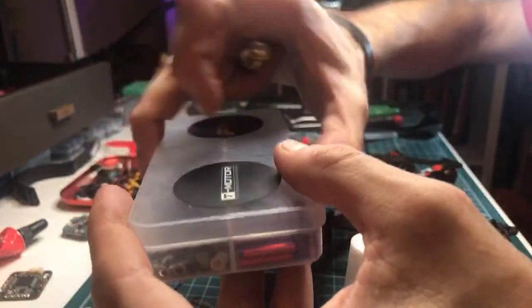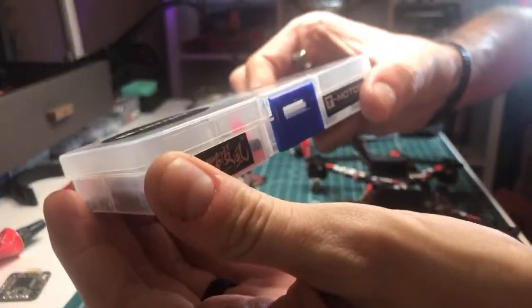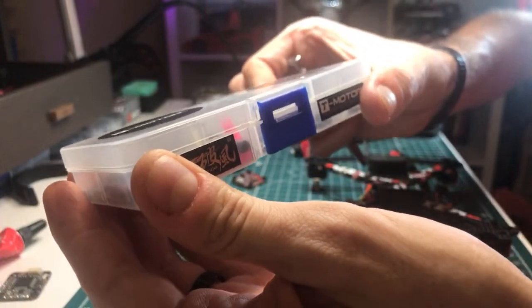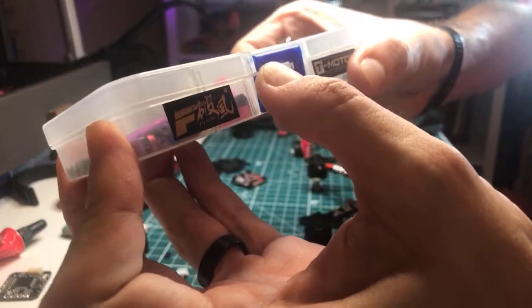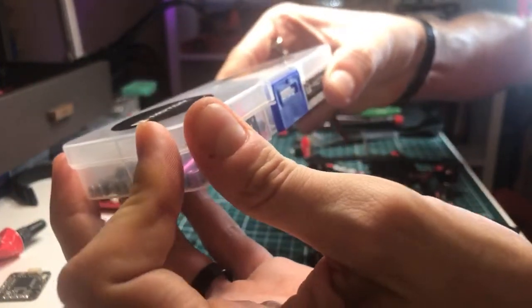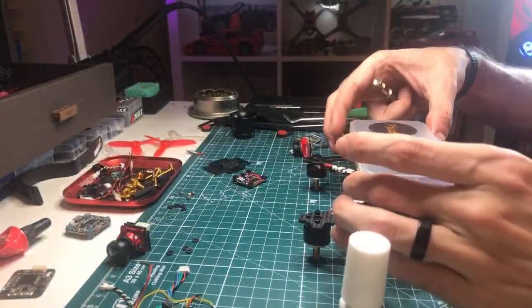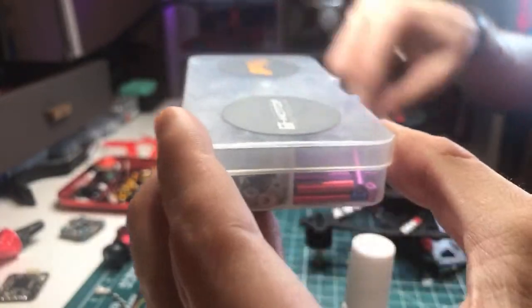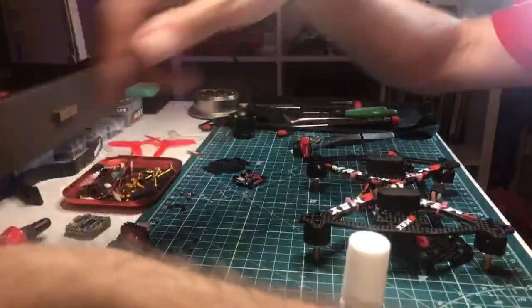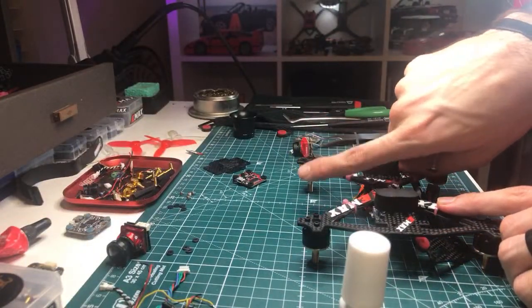Put that lid back on the shoebox and now try to rotate it. You can actually see what's happening here. You can see that latch moving. If that latch was permanently held, this thing wouldn't budge. That's what happens when you put a lid on a shoebox. So that's what the center section of an alien frame is doing. It boxes itself in, and the center section becomes really rigid to twisting. So the only flex you really get is in the arm, the movement of the arm.